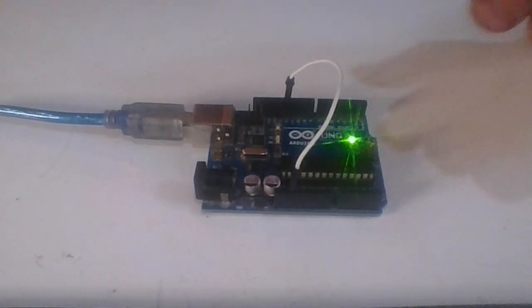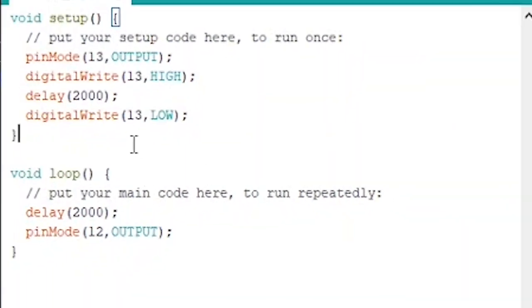Here's the code so the Arduino can reset itself. In setup, we do pinMode and define pin 13 as our LED — we turn that LED on only once to show that we have restarted. We turn the LED high, wait two seconds, then turn it back off. The Arduino will leave void setup and never come back unless it's unplugged or reset.